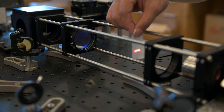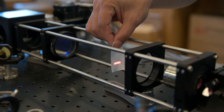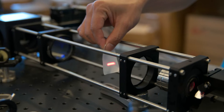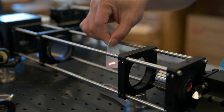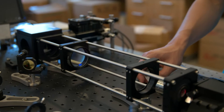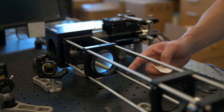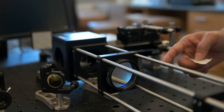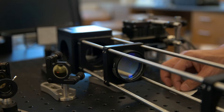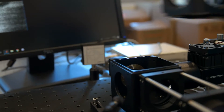here in the horizontal direction. The other mirror is sweeping this line in a perpendicular direction, here in the vertical direction. Combining both mirrors, a rectangular scanning pattern is formed, called a raster scan.